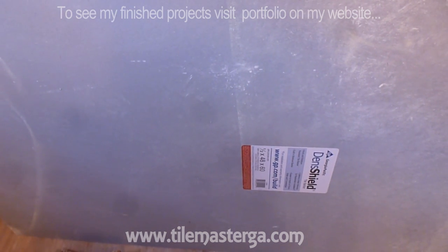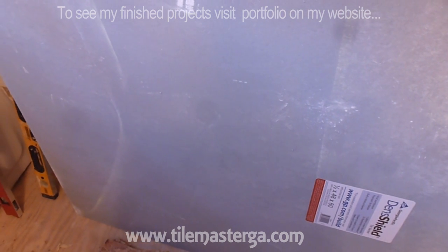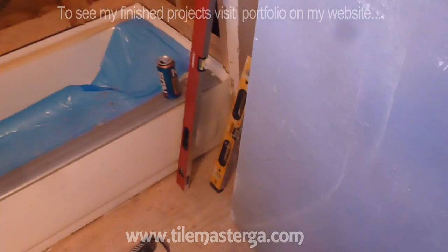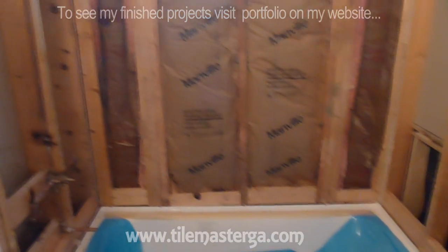The only other product that I would recommend, if we're working with cement board, will be Durock or Permabase, or there's one more from Custom Building Products, but real cement board. Hardie Backer, no. Fiberock, no. Do not use those products. They're not durable. The setting components do not bond to them well. I'm explaining this in one of my other videos. So the most recommended will be the board that I'm using or real cement board: Permabase, Durock, and there's one more, I forgot the name.